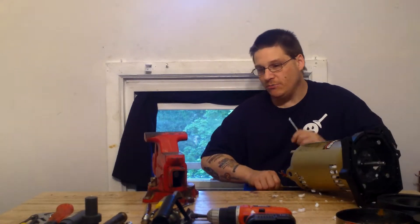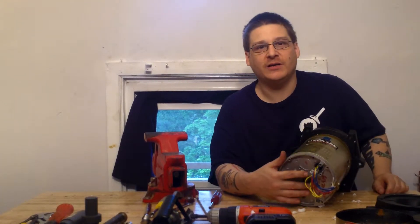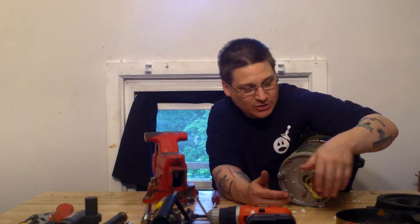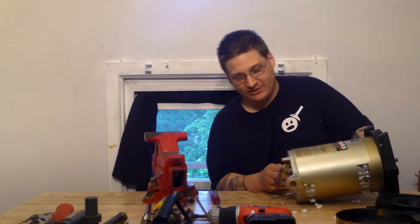You might also be wondering why there's no switch on the back of this motor. On some super pumps, you'll see a switch or a capacitor here. On bigger super pumps like a Hayward Northstar, 230 volt or 110 volt or 230, you will have a capacitor and a switch. But this pump is actually something called three phase, which means there are three actual lines of electricity and no capacitor is necessary. This wire actually runs 230 or 460 volts, so you'll just see three wires because it's three phase.